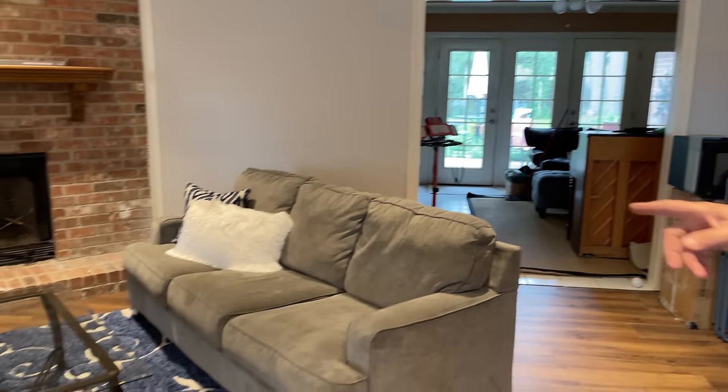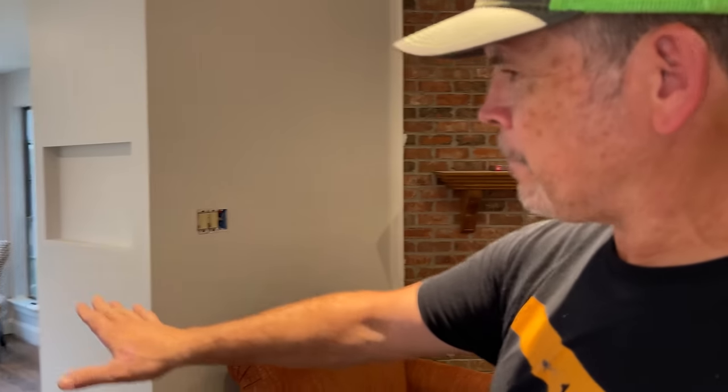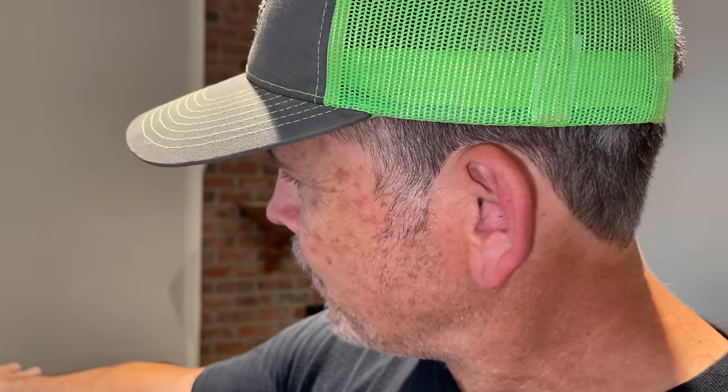Who does that? And why don't people put flooring under dishwashers? It's crazy. You're only saving like a couple bucks. Yeah, and then it's hard to get out. So then we worked this direction. We had the 45 degree angle over there. The tile that we're gonna put a transition strip on. We went under thresholds. We did, over here, wrapped around that 45 degree corner, into the pantry, into the laundry room. And we had 9 boxes left over. We usually have one piece left over. So good job on estimating.